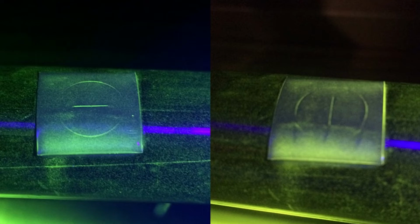However, with the advent of multi-directional or MD units decades ago, the inspection time of many smaller parts was dramatically reduced. So without multi-directional capabilities, the longitudinal and circular magnetic fields created by a mag shot would cancel each other out. This in turn also eliminated any residual magnetization holding particles around indications. Therefore, an inspector would need to mag, inspect, then mag and inspect for cracks in the other direction.